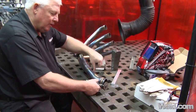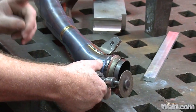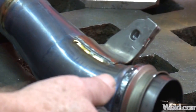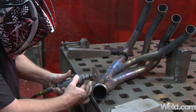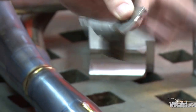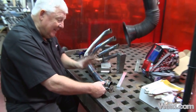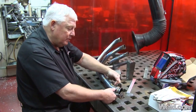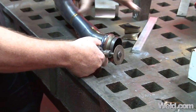Now you can see I cut a little groove right here — we're going to remove this bracket and trash it, no reason to salvage it. Something critical with titanium is you don't want to overheat the material while grinding or cutting a slot. Don't put too much pressure on it — you don't want the material to get cherry red. If it gets cherry red, it's going to turn blue on you and you've got oxide. So you make a slit, go down so far, then make another cut — just light pressure each time. I didn't damage the tube, though I may have to do a repair. We're going to polish it down, then measure, cut, and salvage this little piece, because we're going to be putting stainless steel to titanium, and we have to do it through this type of bracketry.